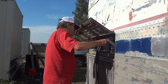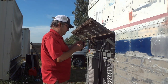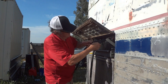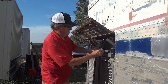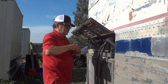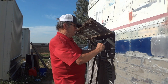That, in my estimation, is plenty. Now you've got your cambric, you've got your raw rubber that flatly sticks together and cures. And last but not least, I could use a little piece of raw rubber stretched up into the crutch of the connection.